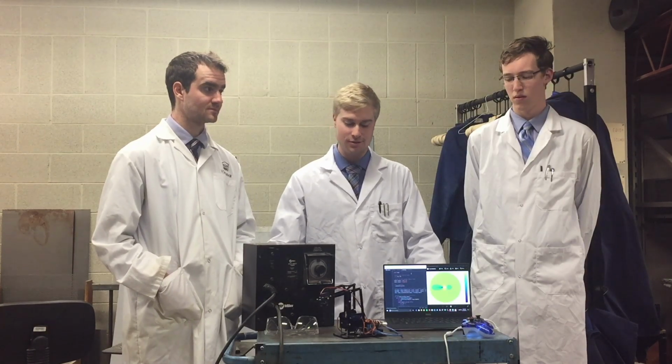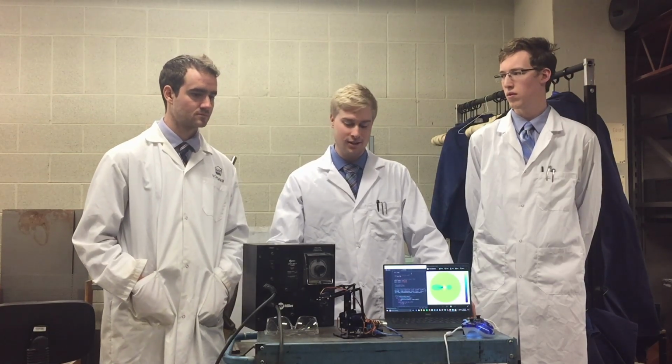A second error occurs when the force properties of the servo motor are exceeded. The servo motors are rated to a force of 9 grams. Once this force is exceeded, a similar callback error occurs within the ROS serial node. This exits the serial node and must be restarted.